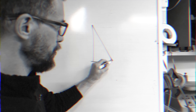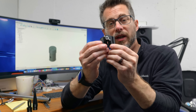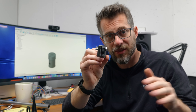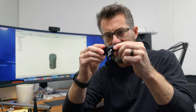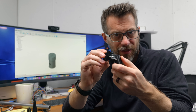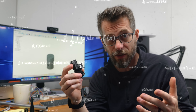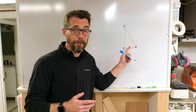The next thing I needed was a hinge — in fact I needed two of them. There's a triangle: I need a hinge at the top and the back, so I modeled one that would work in both situations based on the same post. I got a really simple hinged piece here — the bolt that goes through it is a quarter-20, which is super common, used in photography mounts and lots of other stuff. And once I had this thing I realized I could use it for all sorts of different joints, and I started realizing I was actually building a system of objects that would all attach to EMT conduit — way more than a soccer goal.